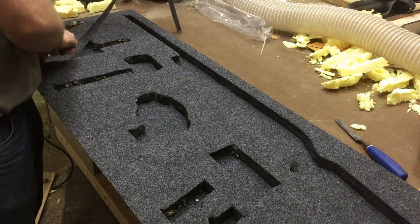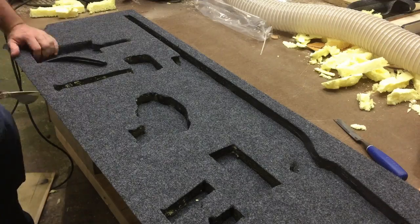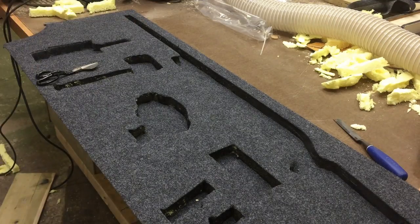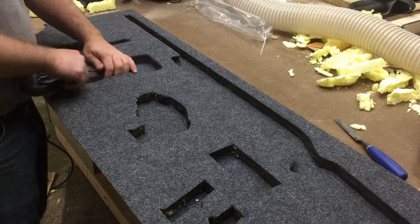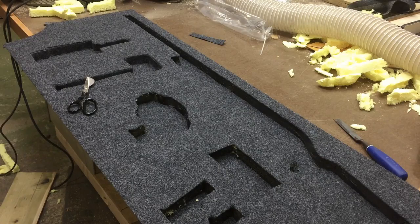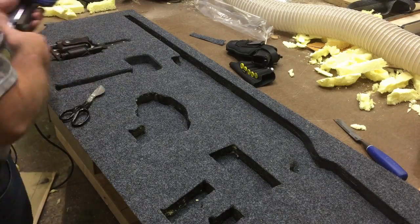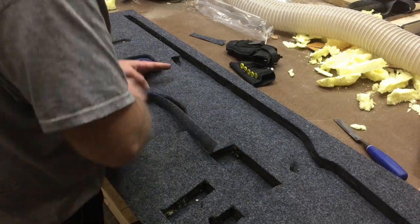All that's left now before installation is to cut out the strips to do the edges between the bottom layer and the top layer. Now, lucky for me, my 4-foot level was the exact thickness of the hollow core door, so I used it to cut several strips of the carpet and then went ahead and pre-glued them. I then used those strips to fill in all the edges.